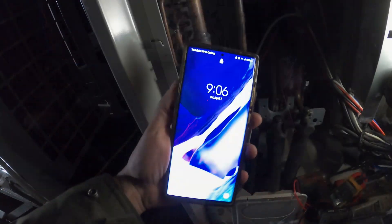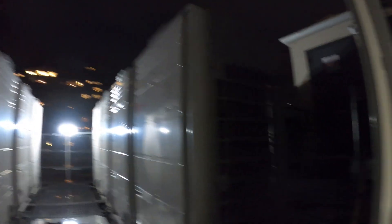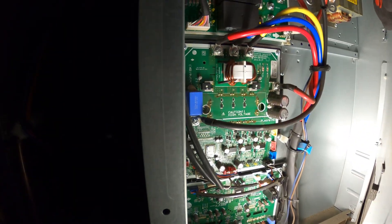Bad inverter board and compressor on its way out — might be a good idea to change both at the same time. But there's no way we're getting them running right now. There are 9 rooms — this is a hotel — so 9 rooms with no heating or cooling, which is terrible. Honestly the best thing is to change both, but I wonder if we change just this board on its own, will it work? All right, it's 9 PM — we got the board, we're going to quickly change it and give this thing a shot.